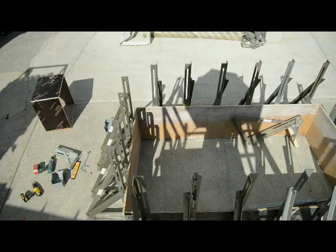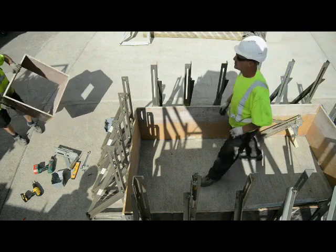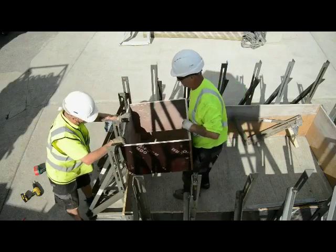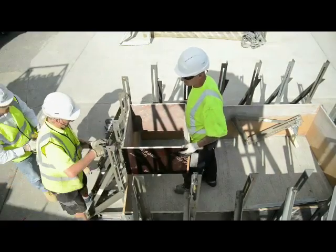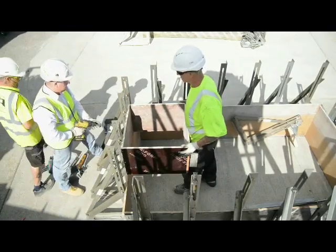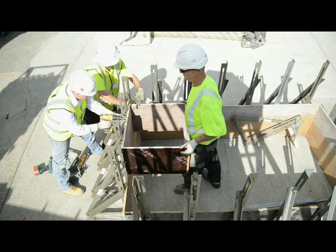So now we're going to show a plinth going on. We've got all the videos on our website that show hanging bolts and hanging kickers, so all the same sort of function. We've made a box ready. So it's very easy to just screw the box into place, again from the back of the brackets. Now this plinth box is designed for a pile cap with a plinth and bolts in it.